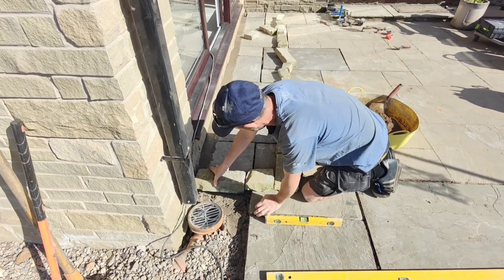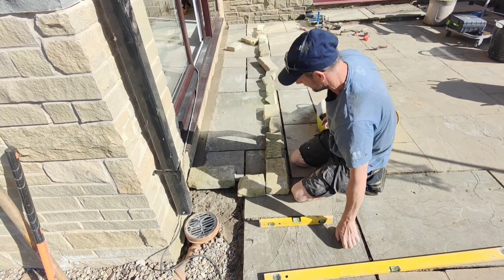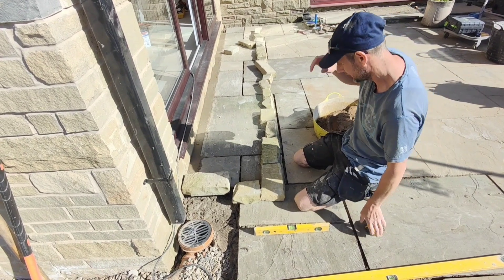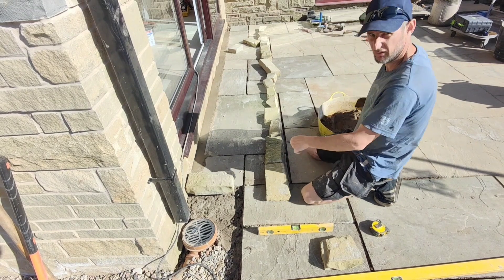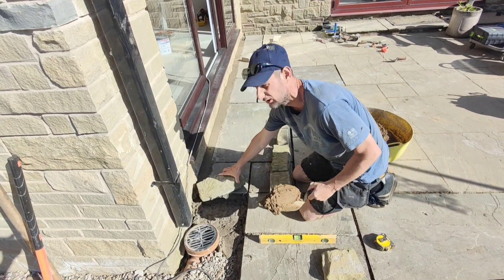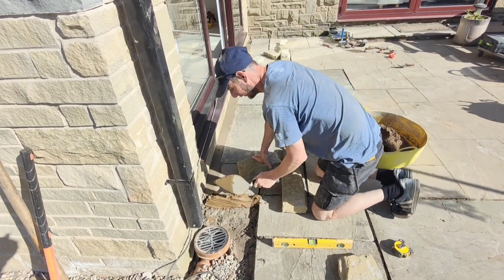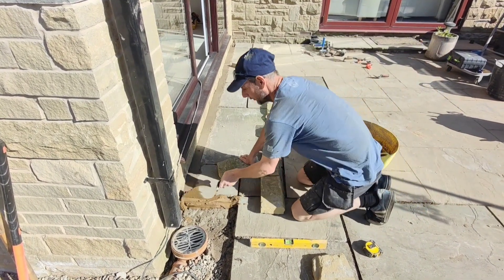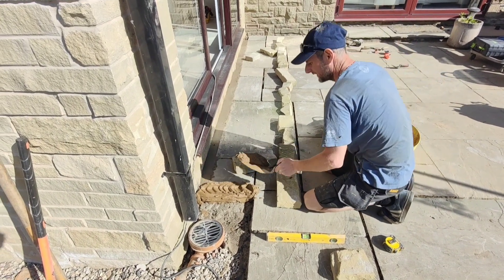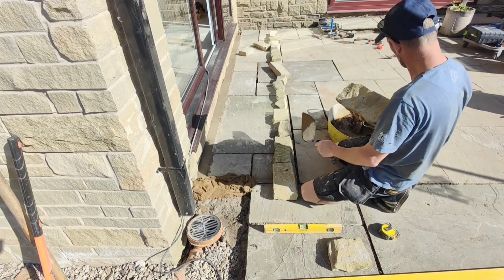So about halfway — it wants to be about half way up. A little bit more, I guess. Big flags, 600. They want a bit of a lip so they want to be a bit less. We've already cut these, just sliced them in there. This mortar sounds rubbish — it's what we've got, big pile of it from ages ago. It's got lumps in it, stones in it, it's the wrong colour. We'll leave the pointing out and point up another day when we get a proper mix — it's got lime in it and we haven't got any lime.